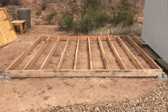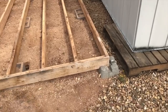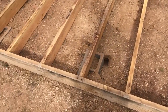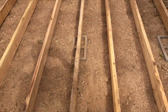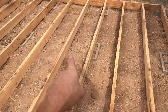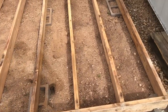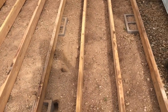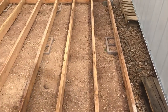Here we are now with all the plywood pried off. You can see I've got the corner piers — I think those are called deck blocks — where the two-by material can sit right into a notch, but I also used cinder blocks in a couple of places. What I've learned about this is I chose to put cinder blocks at intervals along this, which I thought would be fine. But what that means is that a joist here — this joist is 10 feet long — is only supported at the ends. So that's not the best setup.